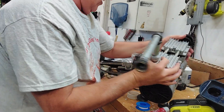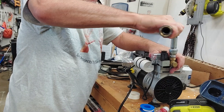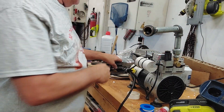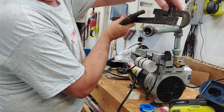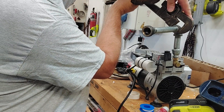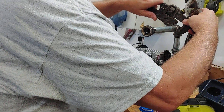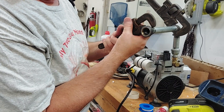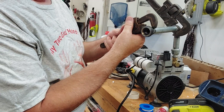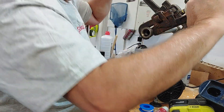Now we're going to put this on a shelf like this — but this would hit the wall so it's got to come this way. We do still need to put a wrench on here, and the reason you want to do that is to not torque on your compressor. Alright, that should work — they're going to be fine.